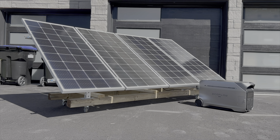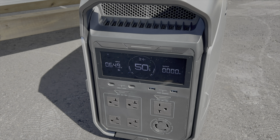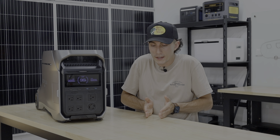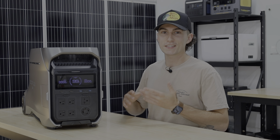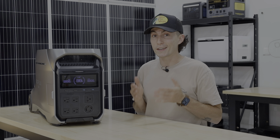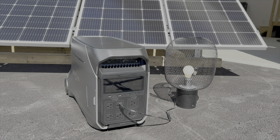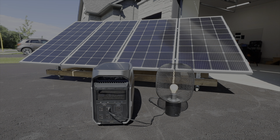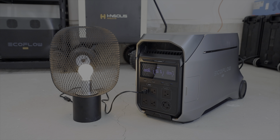The solar input works, though it's very annoying — we'll get to that. Amperages and volts lined up and we didn't really have problems getting the rated solar into this, other than having to run it in two different directions. One of my favorite tests is the pass-through test: if you have something running off the unit and you plug it into the wall, can it power your load and put the remaining power into the batteries? You'd be surprised how many units can't do that. This actually passed for both solar and AC — you can have it plugged into a panel array, still run your load, and the extras charge the batteries.